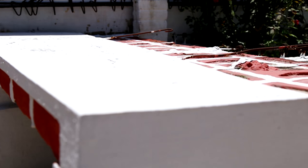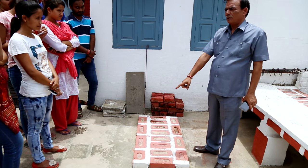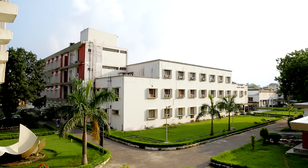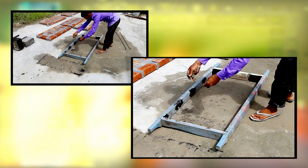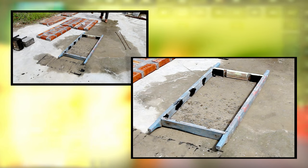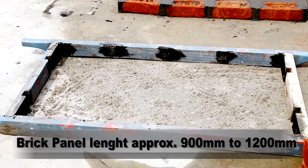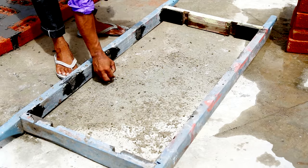This is the concept of making brick panels for building roof and floor structures. First of all, a mould needs to be fabricated in the shape and size of the brick panel, made from seasoned timber of good quality or steel sections. The length of the brick panel varies from 900mm to 1200mm depending upon the room size.